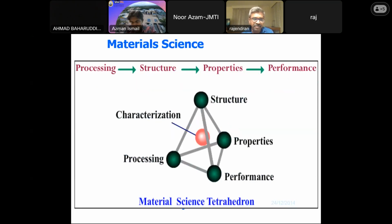So we all know the basic material science: we have the structure, property, processing relation. With this, we are trying to see how we could get the required properties for our automotive component. So we play with the process. We have been talking about the FCC structure, then we will be able to get a ductile material. When we go for the processing, we have different manufacturing processes. We do something like heat treatment, carburizing or nitriding, thereby you improve the fatigue resistance of the automotive component. That is what you are improving, the property. So you can either change the structure or you can change the properties by processing or the manufacturing process. Then you will be able to get the required performance.